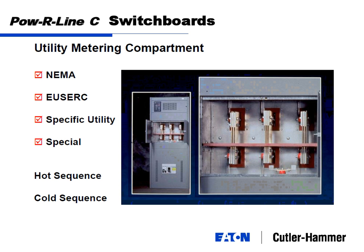One more detail on the utility metering compartment. How that used to be is this here is the CT. It's called a bar type CT. Bolted here, all the current runs through it. Versus normally you'd see a donut CT where you put the cable through the donut and then the CT reads the current going through the cable. Utilities do a little different.